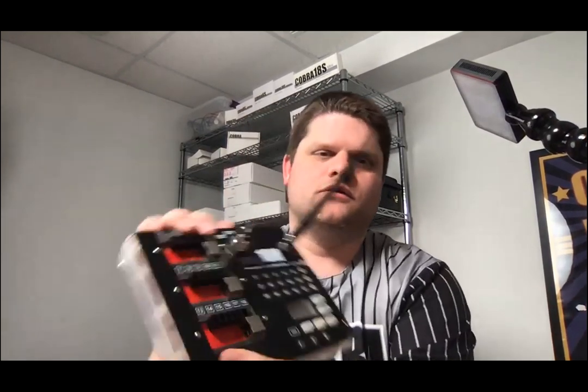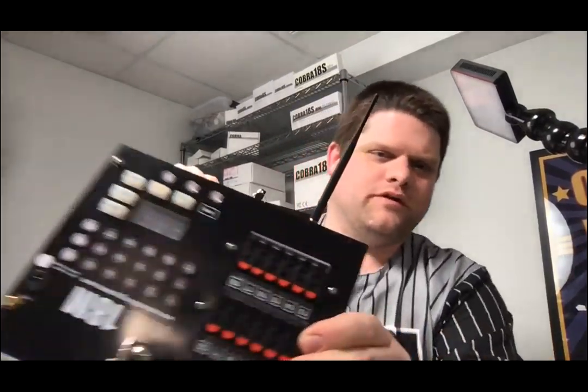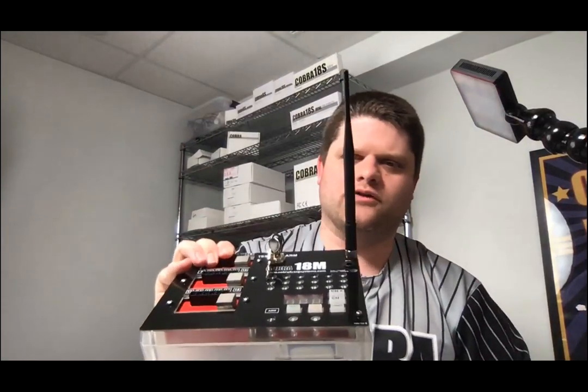Q: When you designed the quick plug cue strips, why didn't you make them the same width as the original cue strips on the 18M? The width of the quick plug cue strip is specific to the width of the plug going in — we wanted one strip that supported all of it. It's a six-bay strip. It also allows for the addition of the RJ45 cat five connection. By having the smaller plug, we could fit that RJ45 in, whereas with a full-width strip, we couldn't.